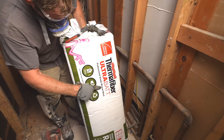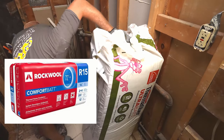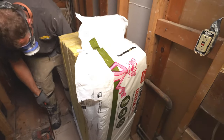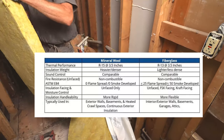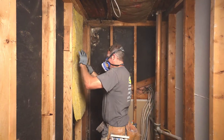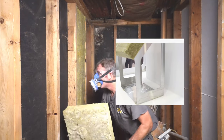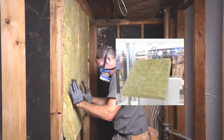My recommendation is to use mineral wool. This insulation has quite a few different benefits compared to traditional insulations, but the primary one is that it's going to have a higher R-value. In a 2x4 wall you'll be able to get an R15 versus an R13. The other reason I really like it is that it's really easy to install and it doesn't have the paper face, so you're going to eliminate that molding issue. Also, if it gets wet it's not the end of the world — it'll dry out and it's not going to be a problem with additional mold.